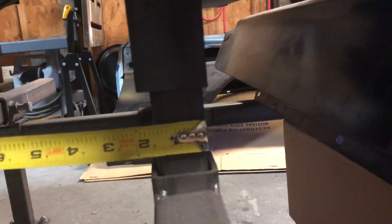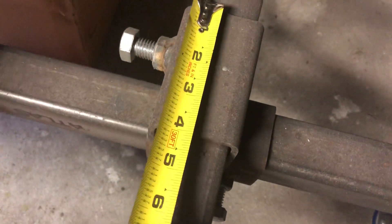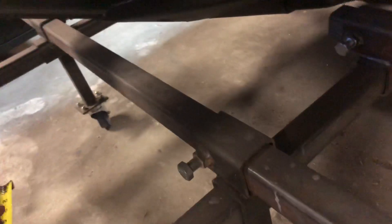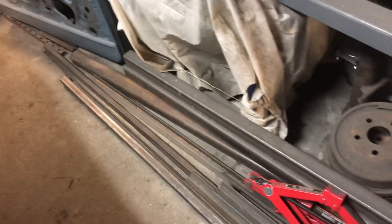The angle iron plates are 2 inch. So the setup is: 2-inch angle plate slider, 2-and-a-half-inch main beam sliders, inch-and-a-half arm with 2-inch angle over it, 2-inch slider on the end of the arm, and 2-inch square tubing for the horizontal adjustment. The sliders I made are 4 inches, both top and bottom. You need a lot of bolts — 2 per slider plus 1 for every arm. I have a lot of square tubing left over from this build, and some from the rotisserie.